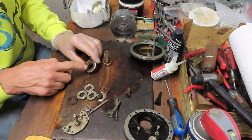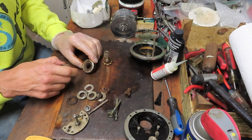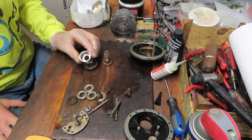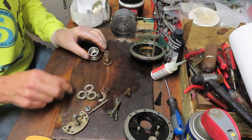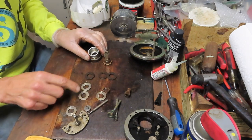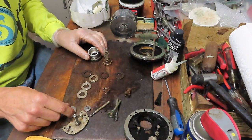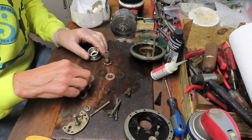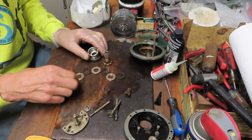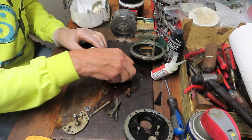The back had a broken washer on it. We'll show you how to fabricate one using a coffee can lid or whatever I can find as a substitute, because you won't find that washer and it needs to be a hard washer. The inside of the cup is pretty good. We have three cork drag washers that came out of that sleeve - they're fine. We have the traditional setup: a round washer, an eared washer, a round washer, and a cap washer. All of that is good.